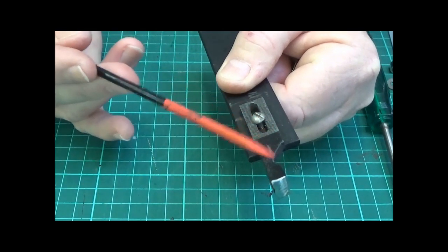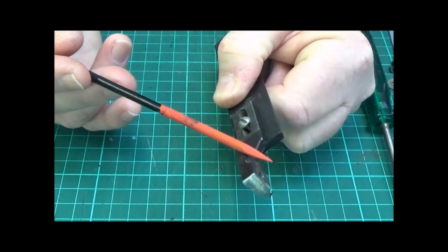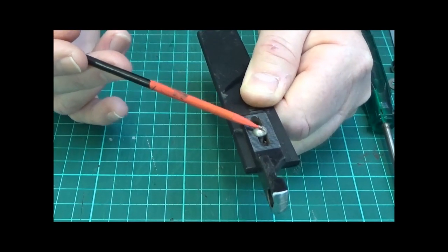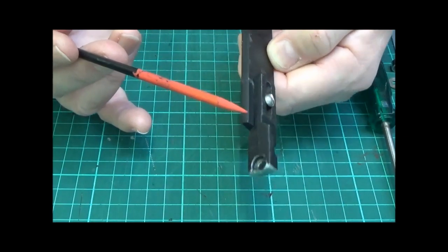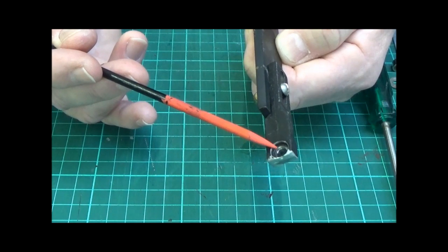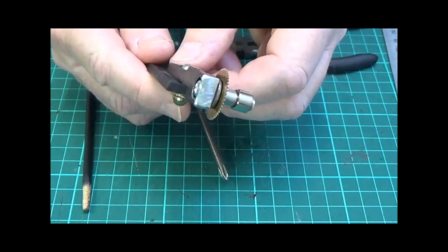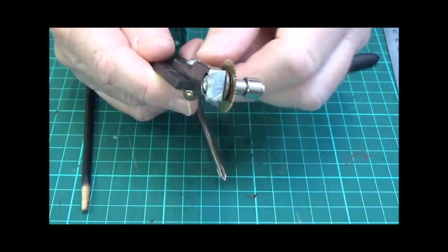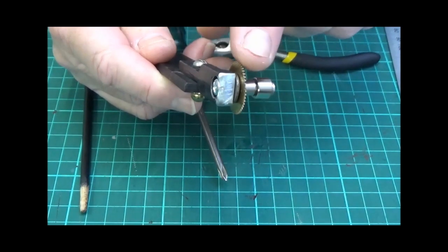The parts I've used is this piece here, which is a bracket that holds a wheel for a sliding door fitting. I've cut it down a little bit, and there's a piece of steel here. It already had a hole in it, so I just put a screw through the bracket through to the steel, and that forms the handle. The sliding door fitting has the hole there, and I'm using the screw that was in there as the axle for the gear wheel. I've put the screw through the hole, through the shaft on the gear wheel, and this is a little circular nut on the end. I've got a washer in between the gear wheel and the bracket just so that the gear wheel doesn't rub on it. It's as simple as that — you can make your own version of this.